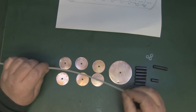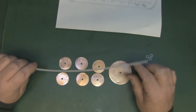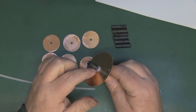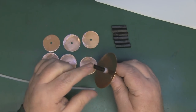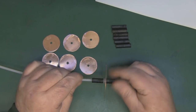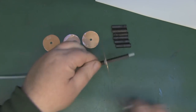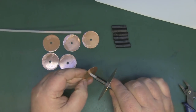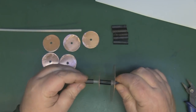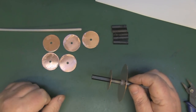I'm tying everything together with M6 threaded nylon bar. It doesn't have enough strength on its own, but with the spacers in between there'll be more than enough to hold all the elements inside the can. I screw a few turns into each spacer, cut it off, place the next parasitic element in line, screw in the next spacer, and keep working down until all elements are in place.